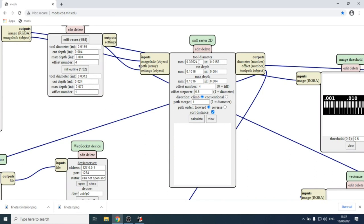The next node specifies basic milling parameters for the toolpath, including the tool. The preset tool diameter is 0.39-something mm, but since we're using a 0.4 mm tool, change it to 0.4 mm. Values can be entered in inches or millimeters — in Europe we use millimeters. The copper layer thickness is about 0.1 mm (the actual value is around 36 micrometers, but we assume 0.1 mm for precision).